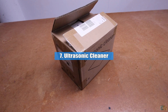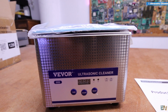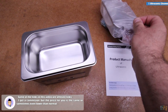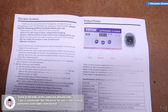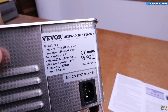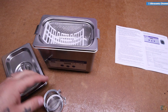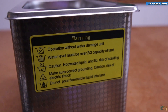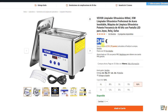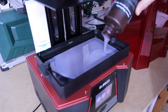Next we have another tool I bought for my workshop — I always wanted an ultrasonic cleaner. It's nothing fancy, just a cheap cleaner from Weber, and by the way Weber is not sponsoring this video, I just like their products. This one is only 800ml because I don't need more than that. It usually works with distilled water but you can use other liquids as well. It works at 40kHz — so it's ultrasound and we can't hear it. It costs around $35. Now anytime I need to clean something very well I will use it. Maybe I could test it with some resin prints!